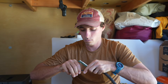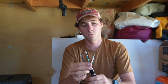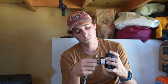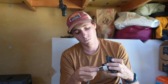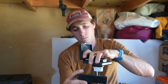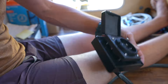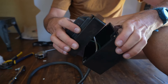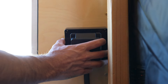I stripped back the 10-3 wire and the individual line, neutral, and ground wires, pulled them into the makeshift shore power wire box, inserted them into their respective line, neutral, and ground slots on the back side of the shore power inlet, and buttoned it all up. I then used machine screws and nuts to hold the inlet to the shore power box, tightened those down, and installed it to the wall. We were really happy to not see a shore power inlet on the outside of the truck, and it's an excellent usable location.